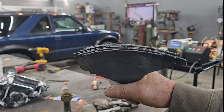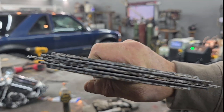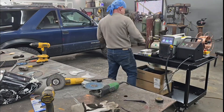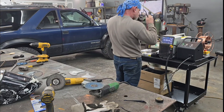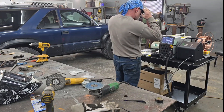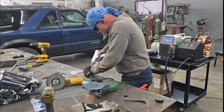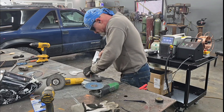This gives you an idea of what I came up with as far as this tomahawk. I'm thinking this could be a good scraper or chipping hammer for welding, because the metal those blades are made out of is really hard — if it doesn't take all the temper out of it while working it. The next thing is setting the laser welder up to actually weld. They did send me the wire feeder; I've got 0.035 solid wire and a steel mix gas, so we're going to see what it's like to do some welding.